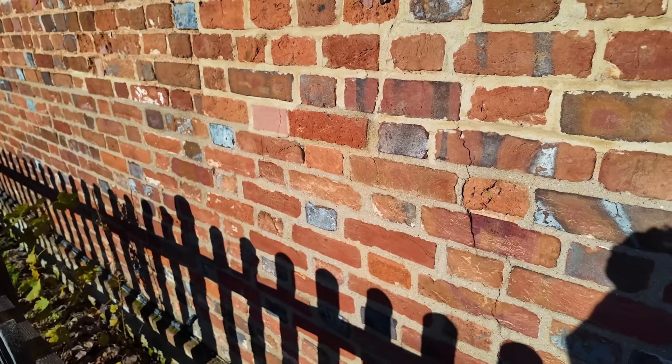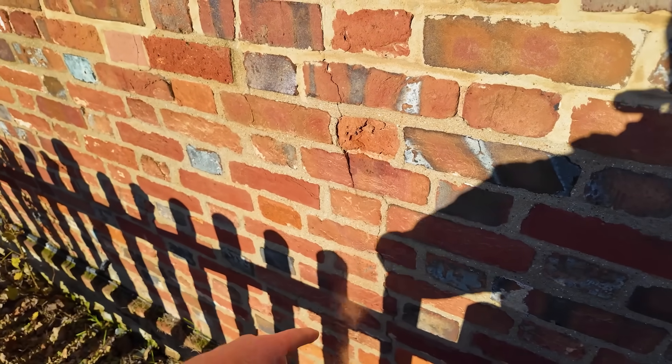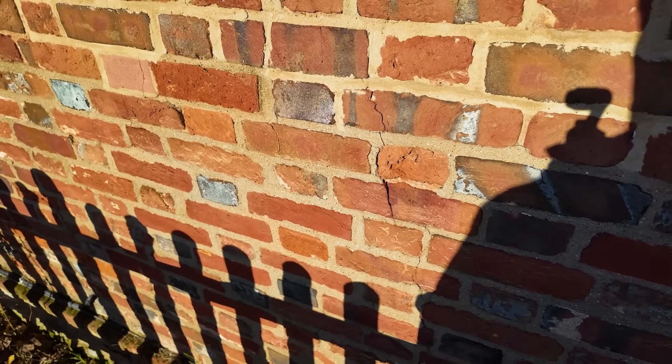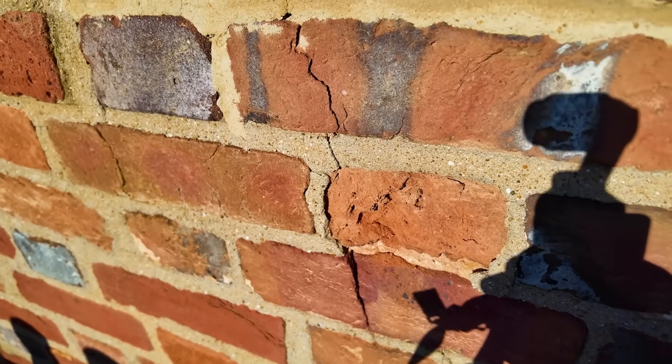Because if you've got to remove the cement, you will find that you do quite a lot of damage to the brick. Lime is great in that respect — you can just keep renewing bricks ad infinitum. And there you see a little crack appearing, going down through the bricks down to the ground. That's a crack that starts in the lime.